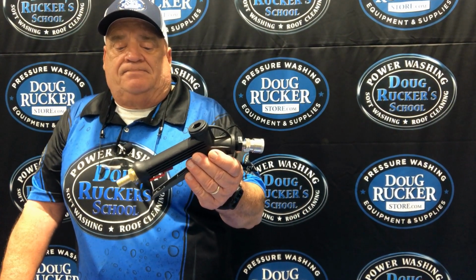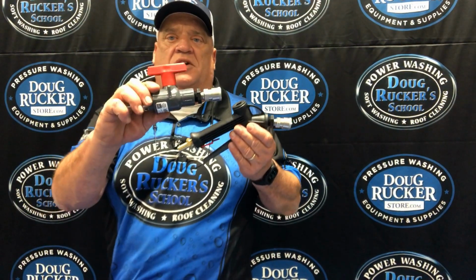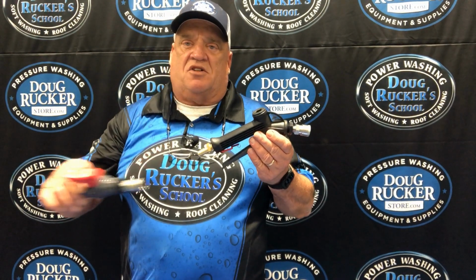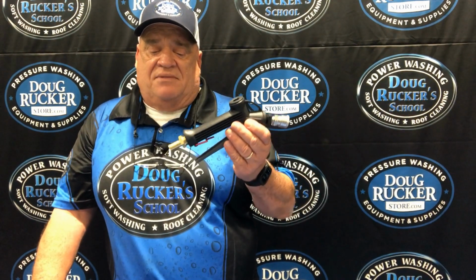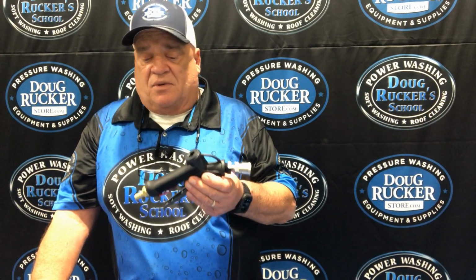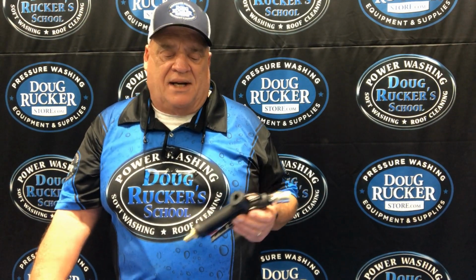If you've got this and you're on a roof and you drop this and it starts sliding, it's still spraying. So you have to be real careful that you don't drop something like that, or you have some measures in place with your ground guide to be able to run over, turn your machine off or something, because if it rolls down into bushes or whatever and it's still spraying, that could be a problem.